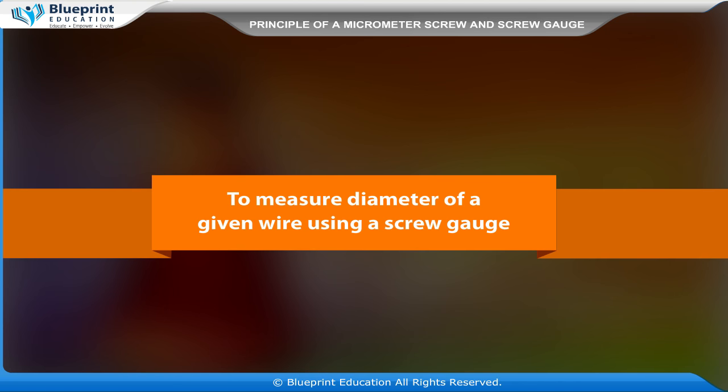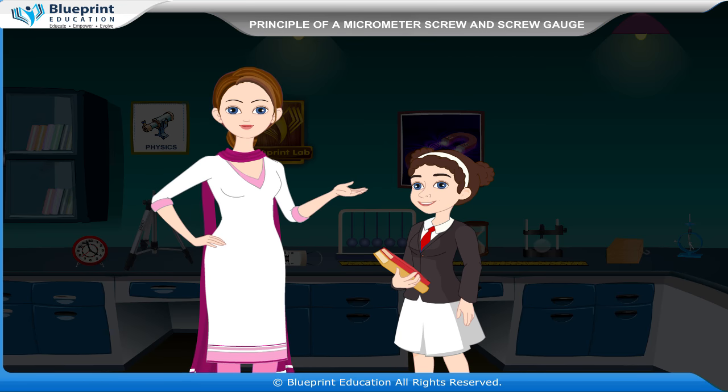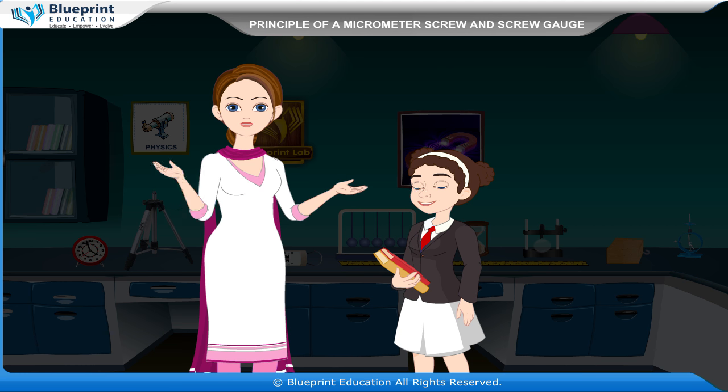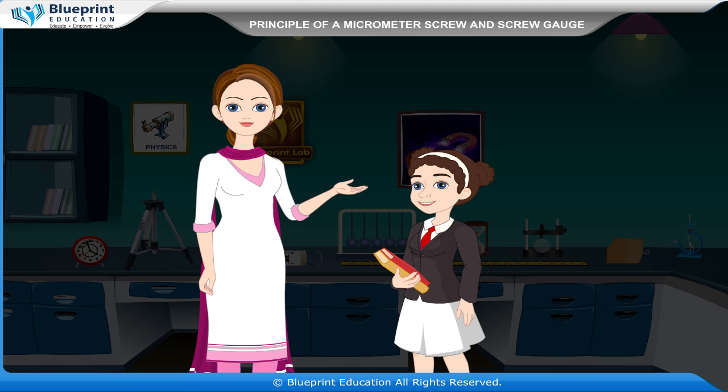To measure the diameter of a given wire using a screw gauge. A screw gauge is an instrument used for measuring accurately the diameter of a thin wire or the thickness of a sheet of metal. It consists of a U-shaped frame fitted with a screwed spindle which is attached to a thimble. Parallel to the axis of the thimble, a scale graduated in millimeter is engraved.